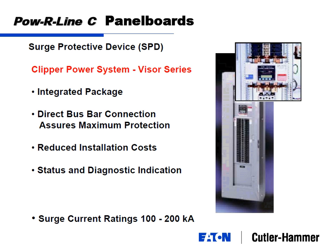Built into this device, we'll have a fixed let-through. Let's say if I'm on a 208-volt system, I will let through 400 volts repeatedly. Here are your wires, connecting these wires to a panel board breaker, for example, to mount this alongside of it. For each inch of wire that you're connecting, you add 20 volts of let-through voltage to your SPD device.